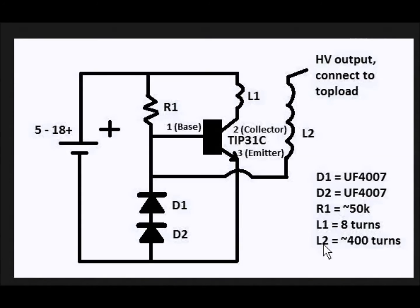I don't know exactly what my gain was — you may be better off using eight turns, but that's up to you. R1, as I stated before, I used a 47k ohm resistor, which worked out pretty well. For diodes D1 and D2, I grabbed some random silicon diodes — they worked okay, though the recommended ones have a high peak inverse voltage and can withstand 1000 volts DC.